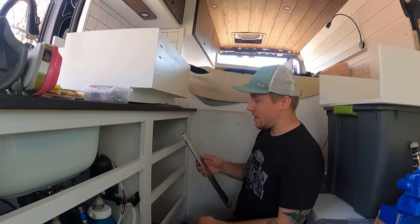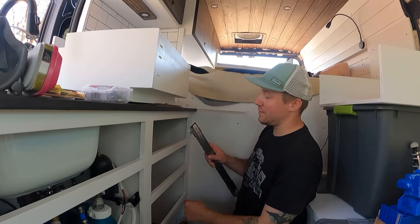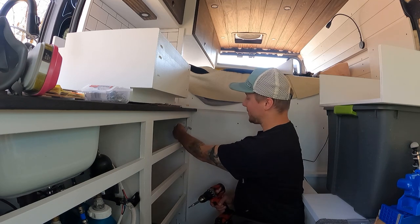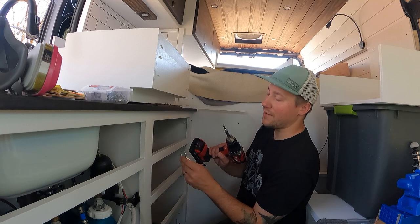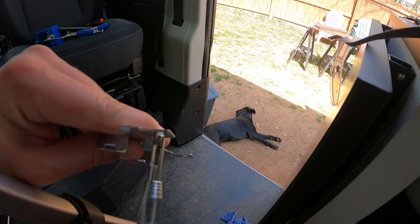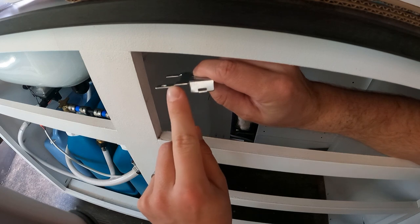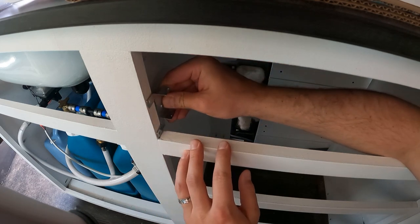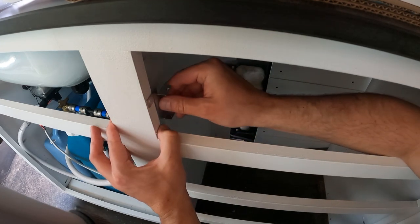Time to get those drawer slides in. The first thing I'm going to do is attach the bracket that goes to the front of the slide. This bracket sits right on the face frame on the inside of it. It takes two screws. I ended up getting a VIX bit for the drill which centers the hole perfectly when you push into it. This bracket has nice little grooves to make sure it sits in the exact spot you need it on the face frame, so as long as you're holding it in there it's nice and sturdy.